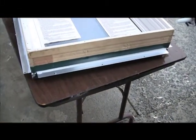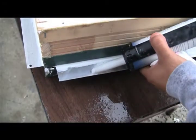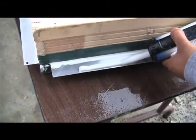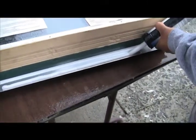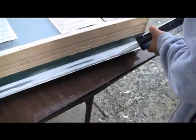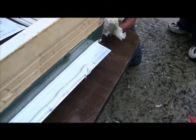At the bottom of the window, since we're going to use a membrane pan, we need to have gaps in our sealant. We've marked three inches to the right and three inches to the left — this three-inch space on each side will not get sealant. The rest of the lower nail fin will get sealant. We're applying about a half-inch to five-eighths-inch bead of sealant to the outboard edge of the nail fin.